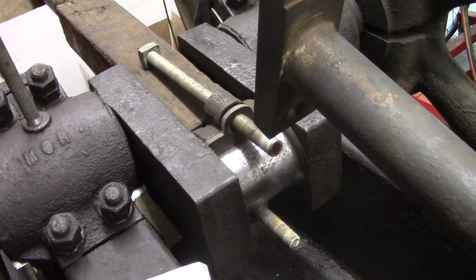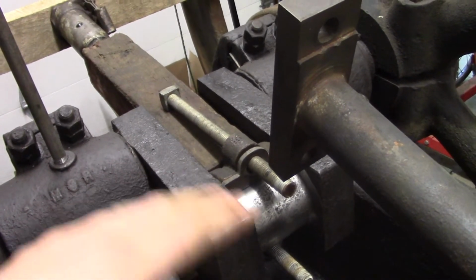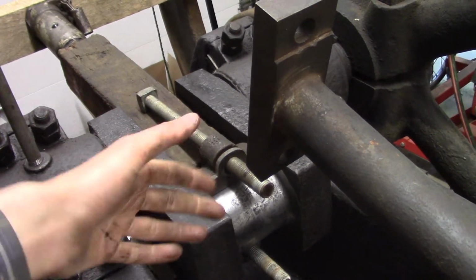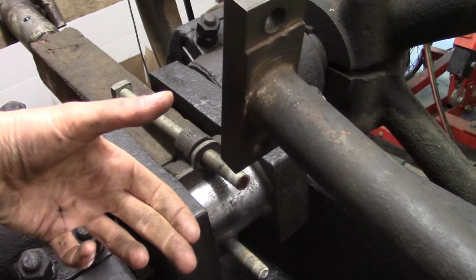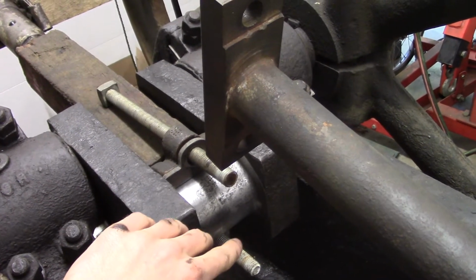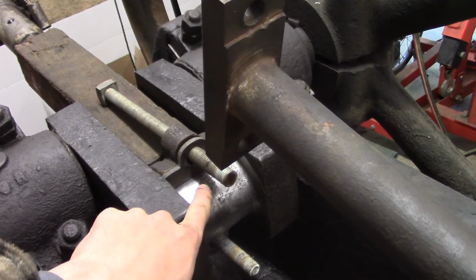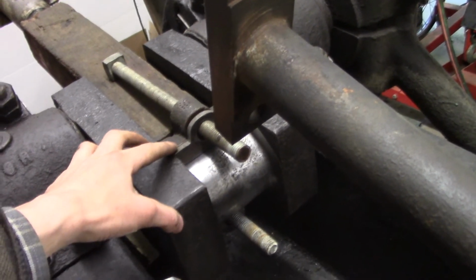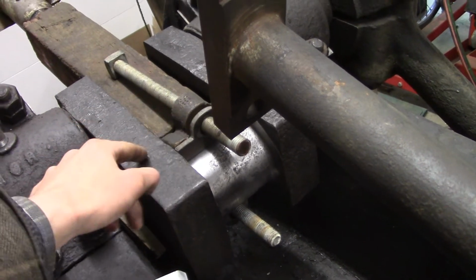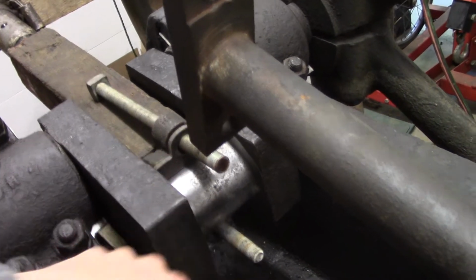So my plan is to set this up pretty much as you see it, make sure everything is level and nicely aligned, make sure this cap isn't rotated too much this way or that way, put those shims on, and then I'll take my oxyacetylene torch and soot the bearing with acetylene soot. And I might actually put a little bit of damming around the very edge of these shims just to prevent Babbitt flow to the other side. I'm not sure if I'll do that, but I might, and I'll soot it.